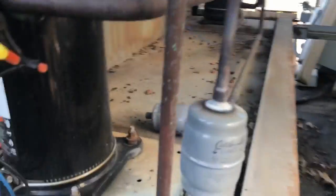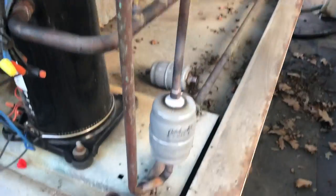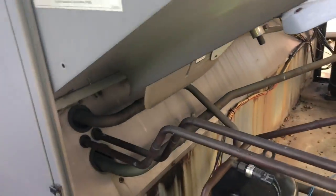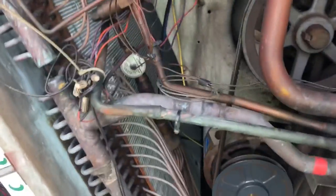Nice brazing job. I always pay attention to dryer orientation — this one's facing down, that liquid line comes up and goes into our evaporator. This one goes up and also goes into our evaporator, so both are opposite ways on this one. The way they go in, they'll be feeding into our valves.